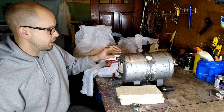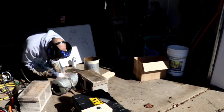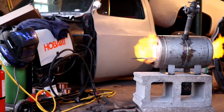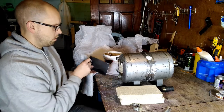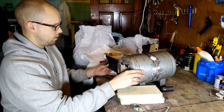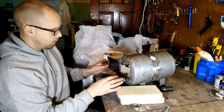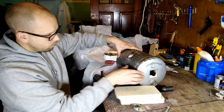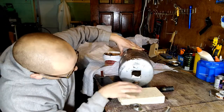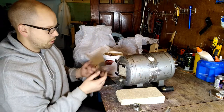We're wrapping up our forge project. We cut the tank, cut 11 inches out of the middle, welded it together, and cut a hole for our burner. We made a little sliding door that slides on some modified angle iron pieces, and we put a 2x2 vent in the back, which should be enough to vent our 3/4-inch burner, along with the door in the front.